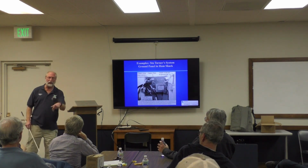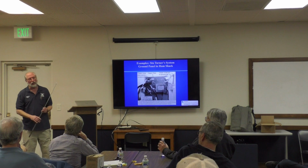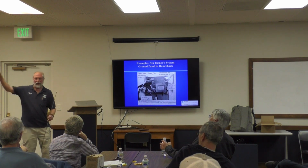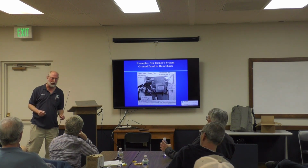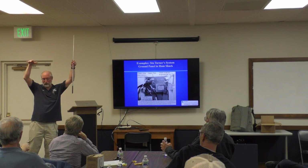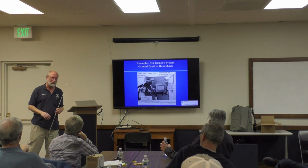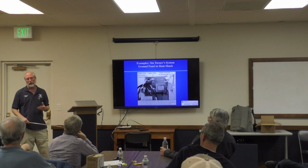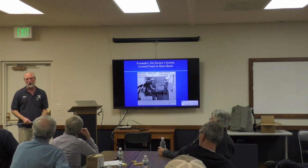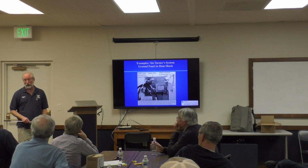Much like a lightning strike on your car protects you, because it's a Gaussian, a complete Gaussian surface around you. If I could take a direct lightning strike on a 10-foot metal sphere that I'm sitting in that completely covers me, it wouldn't kill me. My whole body would float up to 20 or 30 kilovolts or 200 kilovolts or whatever, but there's no potential difference because it completely shields. Okay, does that make sense? It's like the single point ground. If you could embed your body in a completely metal sphere that's a conductor, like a copper sphere, it would protect you from a direct lightning strike, just like a car does a really good job of that.